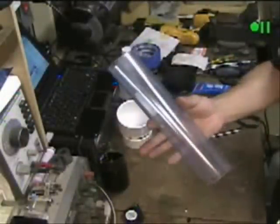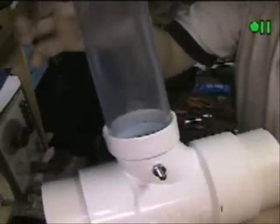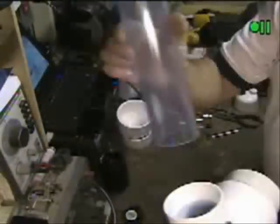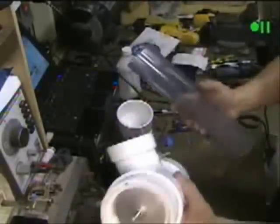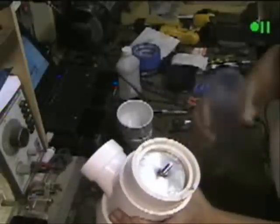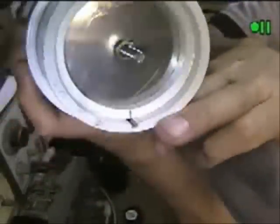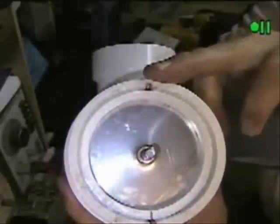Darrell Mason was kind enough to send me a piece of actual 2-inch clear PVC that will go right into the top of the sand tee. I'm going to cut this in half because this is enough for two completed assemblies. Right now I'm just waiting for the glue to set up so that I can pull out the copper wires that I have set in the channels to keep them clear of the adhesive, keeping my channels open so that the electrolyte can enter in between the plates and the gas can exit above the plates.